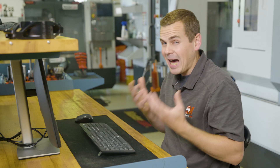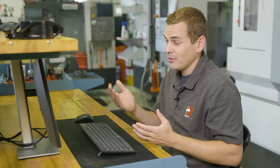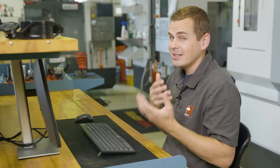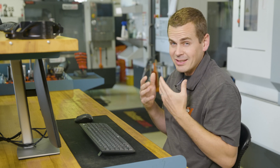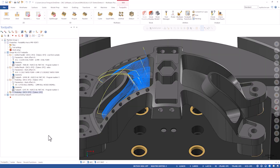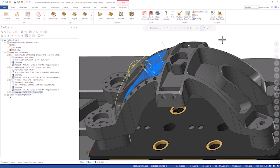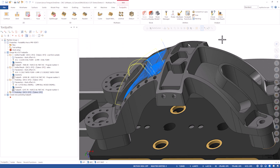So the big question is: how do I program this? It's a very different mentality than you would use with OptiRough. With OptiRough you're picking a plane and basically doing a three-axis toolpath. Here those rotary axes are live, so there's a little different mentality and a few tricks. The way I would typically start is to create what I'll call a stock plug — a stock plug that I want to remove from the part — and the best way to do this is with model prep.